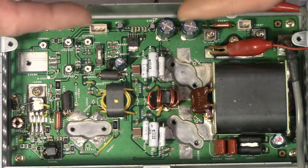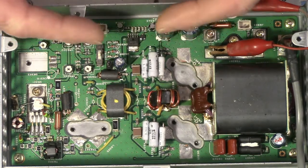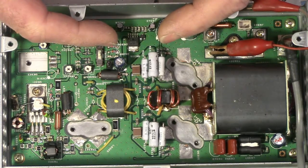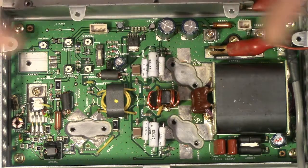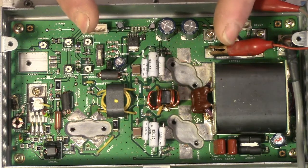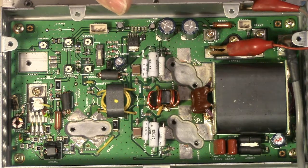So there you go. If this chip were to blow out, if this regulator were to smoke, this would probably have to be replaced with a simple 3-terminal regulator, 7809, and we would add a switching transistor ahead of it, something capable of delivering a couple hundred milliamps. So probably not a TO92, but maybe something a little bigger, but not much. And it is indeed enabled with a switched 9-volt control signal from the control board. So there's a couple of ways that we can supply our enable voltage here.